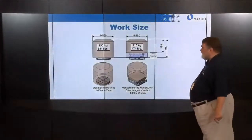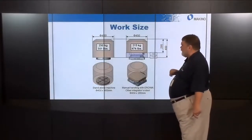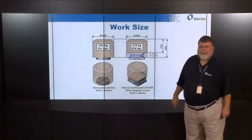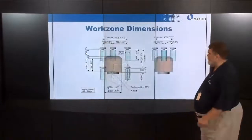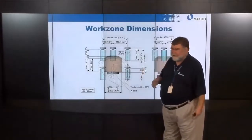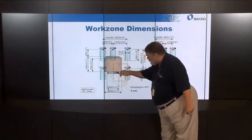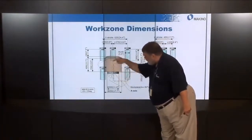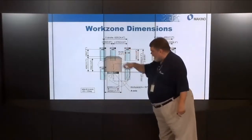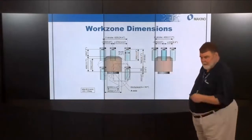For basic workpiece size, you're looking at about a 450mm diameter. We'll show you a pallet-changing machine — about 300mm pallet size and about 500 pounds capacity. Here you can see the basic travels and tilt rotary laid out: plus 120 degrees, minus 30 degrees, 150 degrees total for the A axis, with C on top and X, Y, and Z strokes laid around that maximum workpiece.